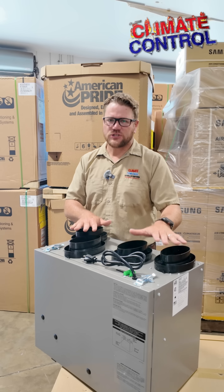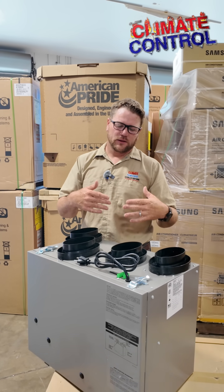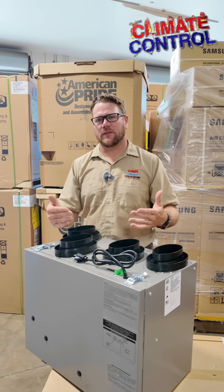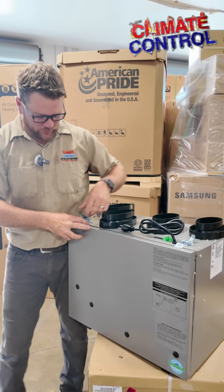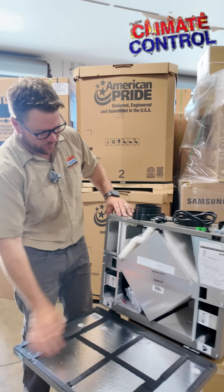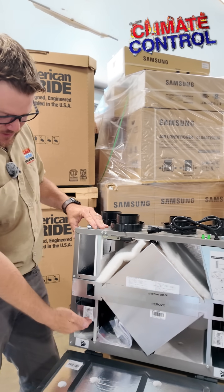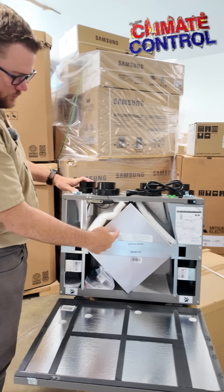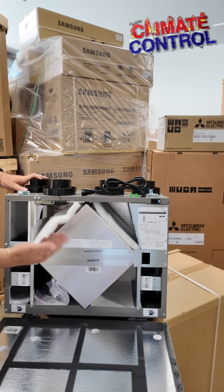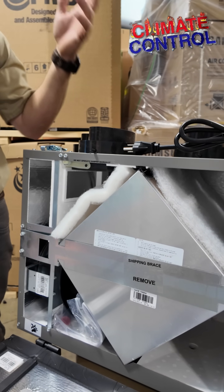These change the air in the house so that way you're not breathing the same air over and over again. You're breathing cleaner air, fresher air — outside air that we're bringing into the home. We're filtering it, and I'll open the front here — it is a serviceable item, it's got filters in it. The air crosses through this membrane and goes exhaust out to the AC unit. Then we're exhausting it back out of the house, taking the old air, the dirty air out, and sending it outside to a louver or wall cap outside.